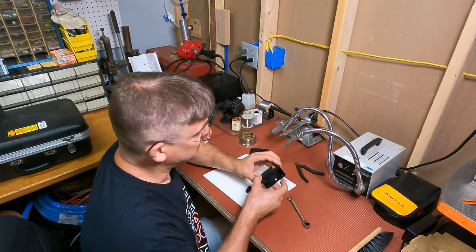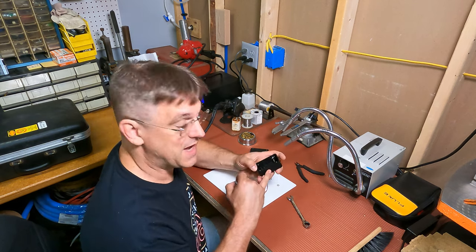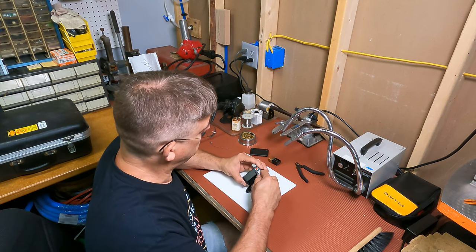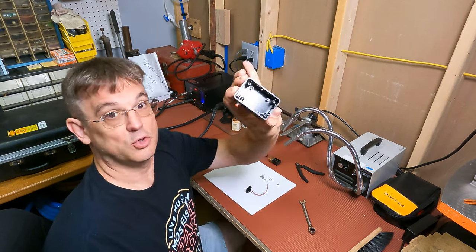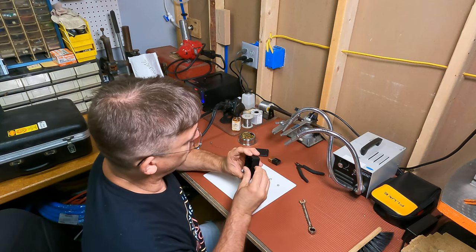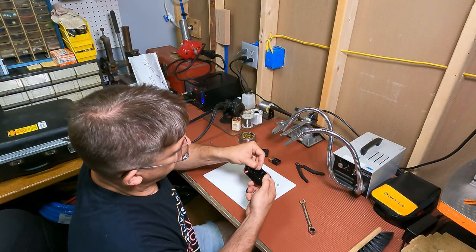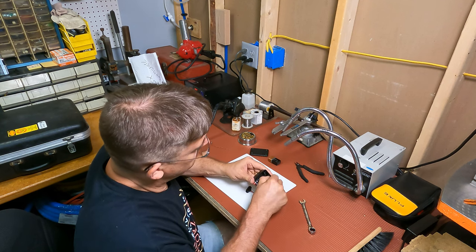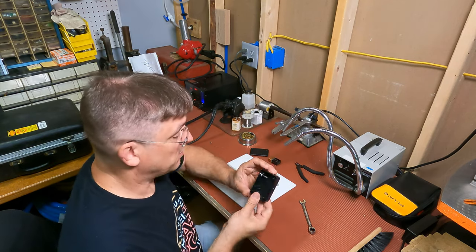All right, so we're going to build the firing circuit next. Here's the hole that I drilled for the switches here, here, and then the grommet's going to pass through the bottom. So I've already got the red switch mounted. That's going to be our fire button, our push button right there. And this little plastic project box, the hole in the bottom is going to be for this grommet. This is what the coil wires from the sprinkler valve will pass through. Let's put that in. There we go. Place for the wires to pass through on the bottom.